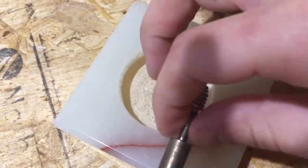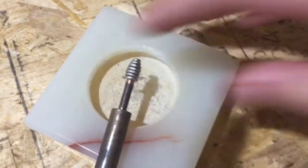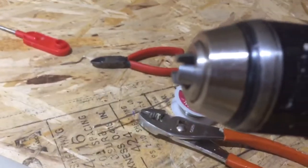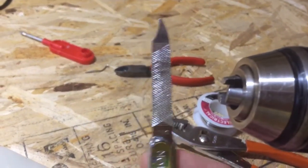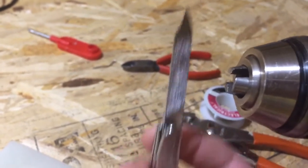To do this, you could remove the soldering tip from your soldering tool and just put it in a drill like this. Get a file — if you don't have a file, use a nail clipper like I did. And just file down the tip to a nice sharp point.